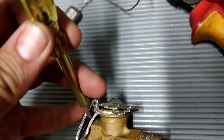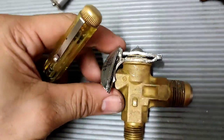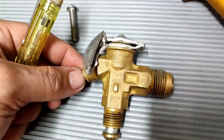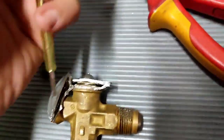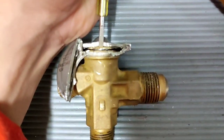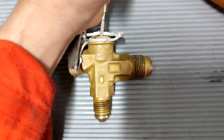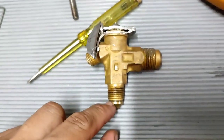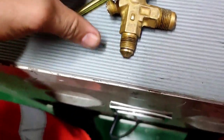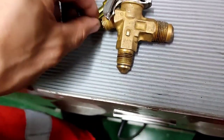There is a diaphragm filled with refrigerant — that is the one that pushes the spindle. Right now the refrigerant is exposed on the sensing valve. You need to cut that one and put a hole with a bolt so that this spindle can be pushed manually, so that the valve will open when you put a bolt on the top part.